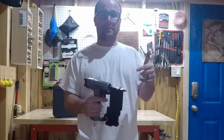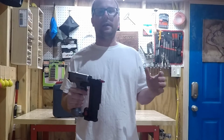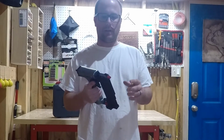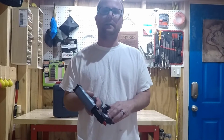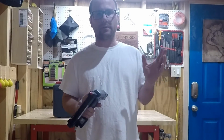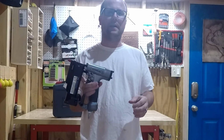Who's going to use this? Fine woodworkers. Incredible. If you need to use nails and you don't want to see them, this is the way to go. Headless or micro head 23 gauge is super tiny. It's really nice. They also have a 21 gauge. Brad nails usually use about an 18 gauge. 21, 23 is the Everwin pin nailer.